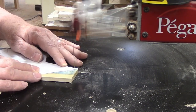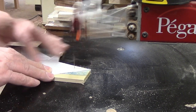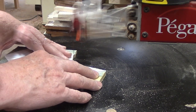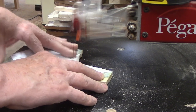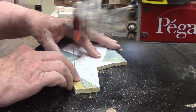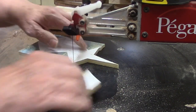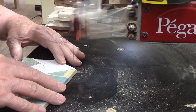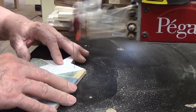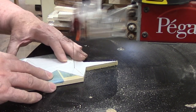The star was the first item I grabbed, and it's a good starting place — it has only four points so it's easy to cut. I started at the edge of the board and aligned the blade aimed right at one of the points. As I reached that point I followed the line to the first intersection — a large obtuse angle — then rotated the workpiece to face the next line and cut along it, following off the end of the board to avoid a tight turn.